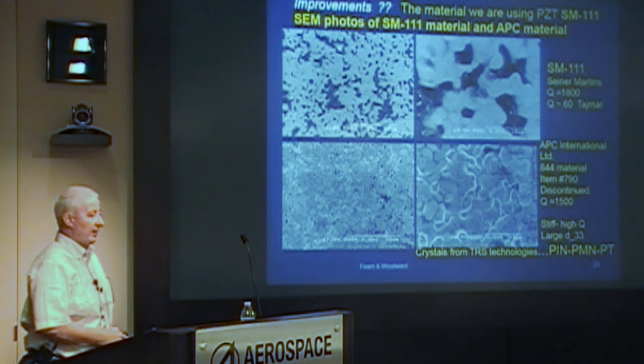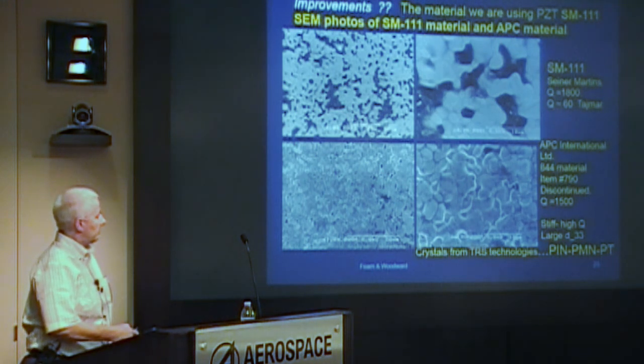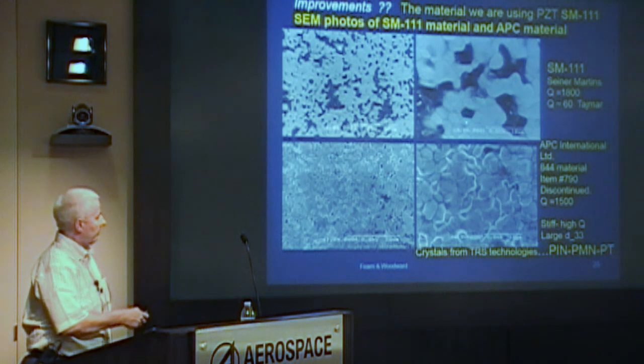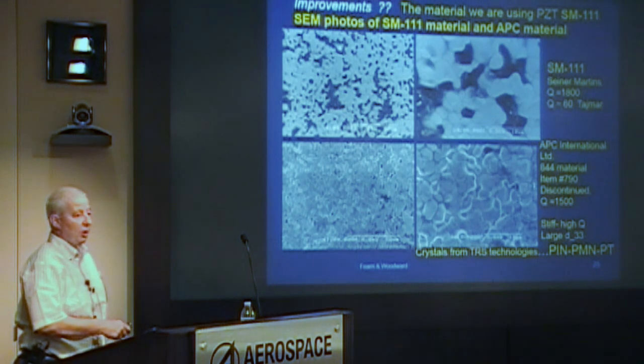So we thought, well, why not buy some different material and see what that looks like, and if it's any better, different quality of it. So I went to APC Limited, and they gave us some material, which I took a look at, and again, the quality factor that they quote is 1500. And this is what it looked like. It seemed to be fewer. The grain size was very similar. It also was between 2 and maybe 6 or 7 microns in diameter. But there seemed to be fewer holes.